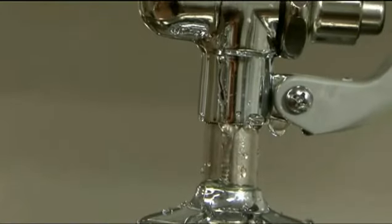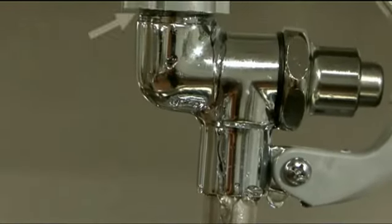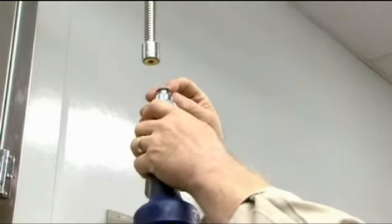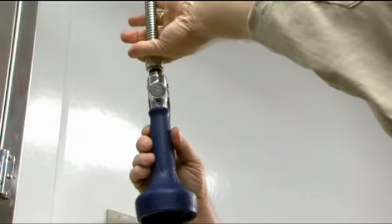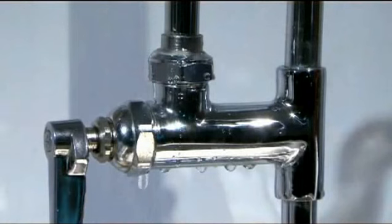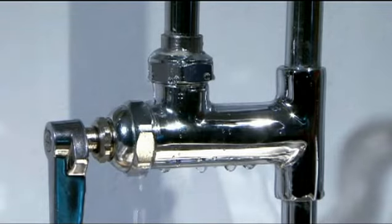But the other common leaks are nearly identical to those on a faucet. If there's a leak at the base of the handle, you'll need to replace the washer inside the handle to stop the leak. A leak at the top of the handle means a hose washer that needs replacing. Leaks around the pre-rinse faucet or riser itself will inevitably be identical to the faucet leaks described previously. Leaky plumbing — no one likes it, but it's not difficult to investigate and repair.